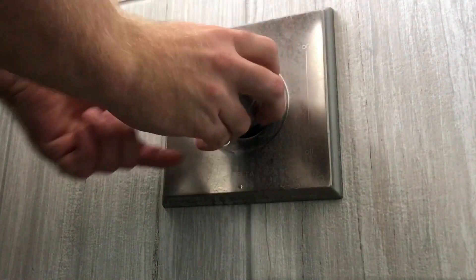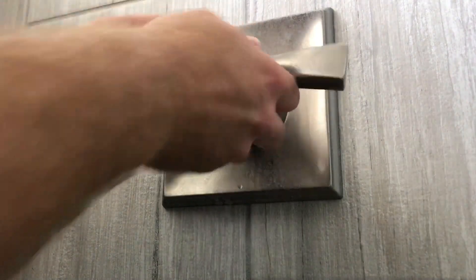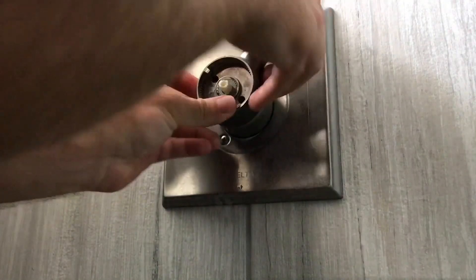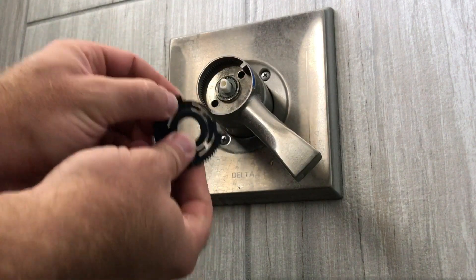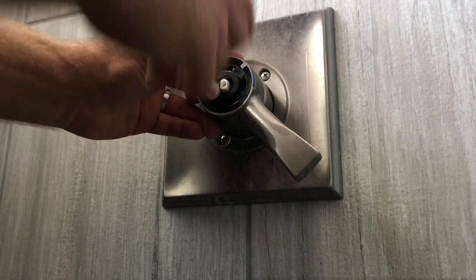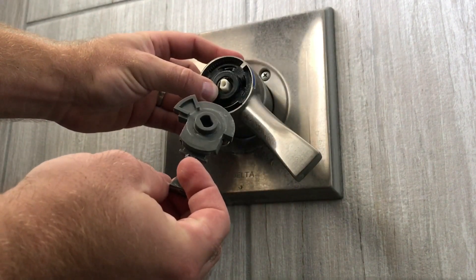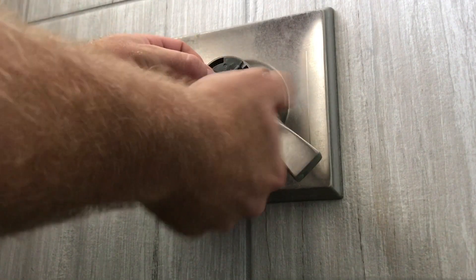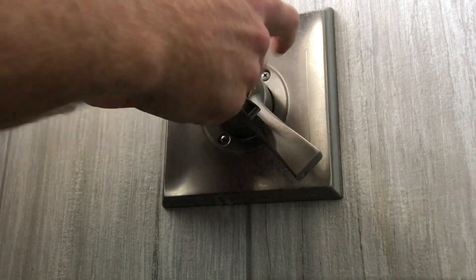Trim ring — remember, you've got an O-ring here that is a seal, but mostly it just holds this thing in place. Trim ring in place; it'll roll backwards as you push the trim ring on, but that's okay. The handle has two little smooth sides that line up with the two smooth sides on the valve. Temperature dial — you've got a C and an H. The more you put it towards the H, the hotter your water will get. So I'm going to put it all the way on the H because I like good hot showers. This is your actual temperature control — it's got a kind of oval-shaped or square-sided slot in the back that fits on the peg, and it should line up with your on-off handle. It's not wanting to turn, which means I got that valve body 90 degrees out.